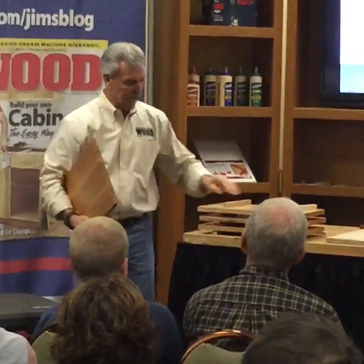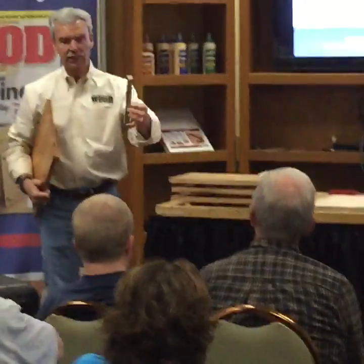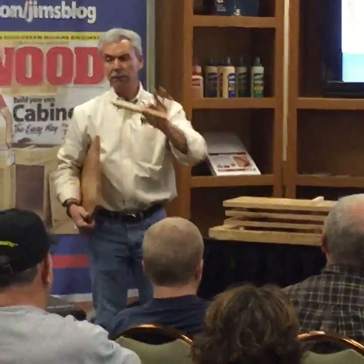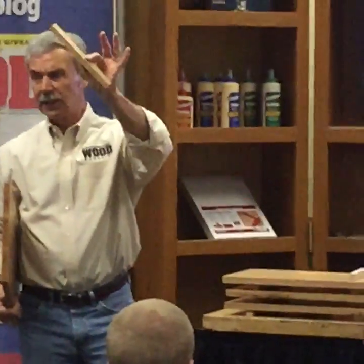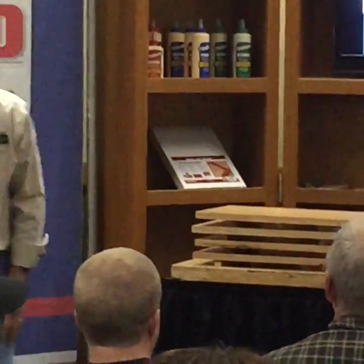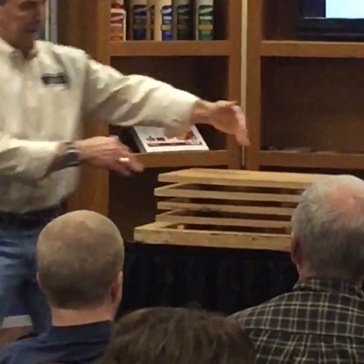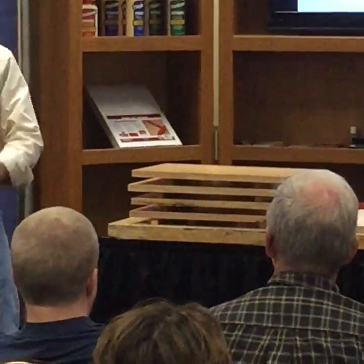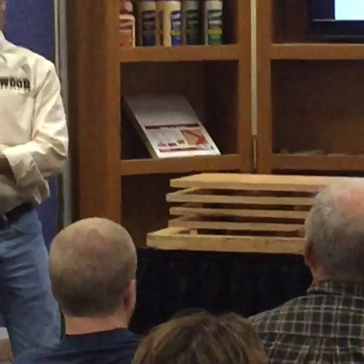It's horribly inefficient, takes up more space than ever, but these are little 3/4 by 3/4 pieces of scrap, and you make plenty of scrap. You make more scrap than a project. You probably have a lot of material to do this with. But the idea is, if I stack it all this way, all 6 sides, the ends, the sides like this, and the top and bottom, can take in or give off moisture evenly. The humidity in my shop is different.